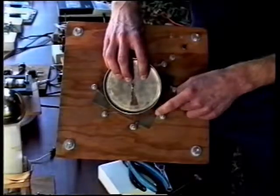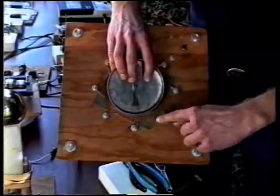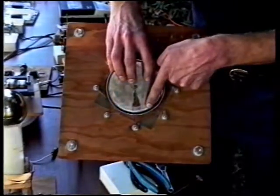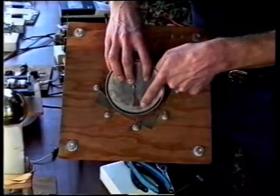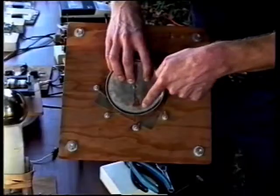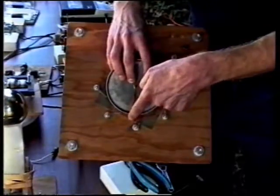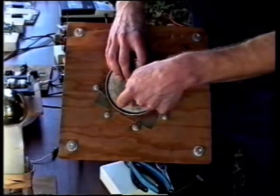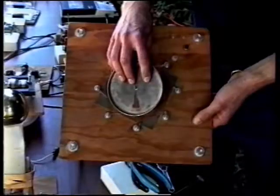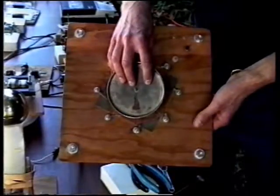As the lid rocks, you can see that the point of contact of the rim rolls forward. So when the lid has finally fallen all the way down to the electromagnet, the point of contact of the rim has rolled over to here, where it is now touching the next copper triangle, turning on its electromagnet, pulling the lid further down. In summary, the point of contact of the rim of the lid is forever chasing the electromagnet that it's turning on, just ahead of itself.